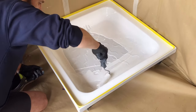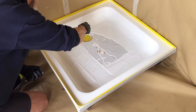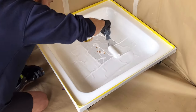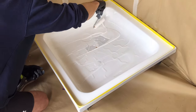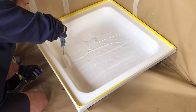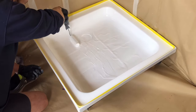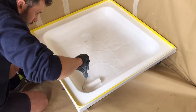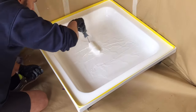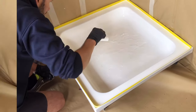Use the roller to push the material around, making sure you've covered any bald spots on the walls. Work the material from the edges to the center, then do a few criss-crosses back and forth to help the material self-level. Get the excess material out of the plug, then criss-cross again working from edges to center. If you notice little tiny bubbles forming, just blast them with a hot air gun and they'll pop within a couple of seconds.